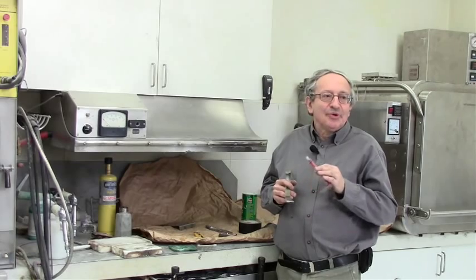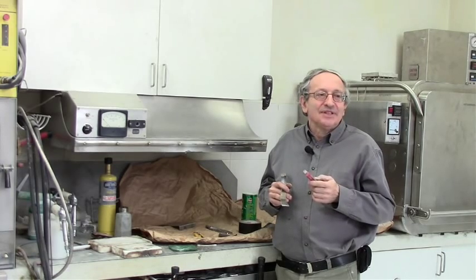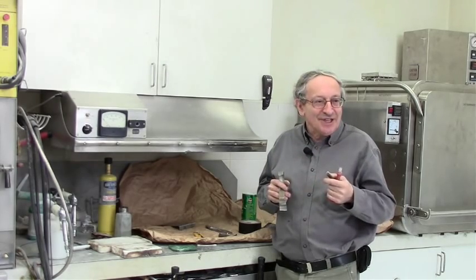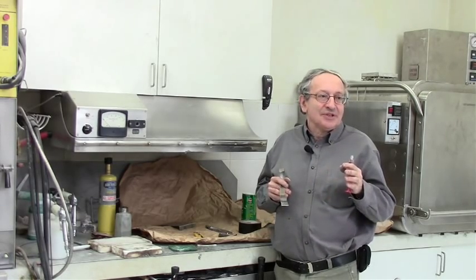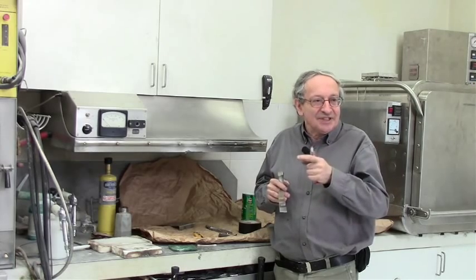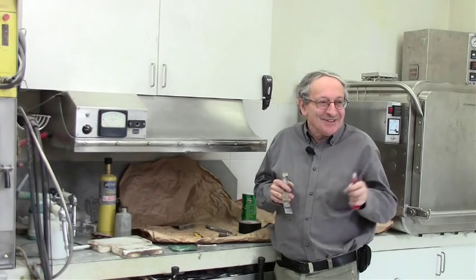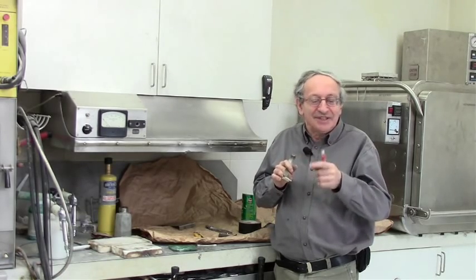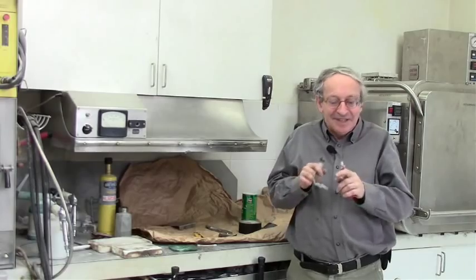Surface energy is a product of the specific surface energy and the surface area. So you can have something with a low specific surface energy but has a highly structured surface, so the total surface area is very large, because what matters is the product. So you can take Teflon, which is hydrophobic as hell, and you can make it hydrophilic by texturing the surface enough that there is so much surface area, then when multiplied by a low specific surface energy, it still gives a big number. So that's the trick. So the trick is why this retains more is simply because what matters is the product of the area, and this has much more area than this. That's what does it. It's not the mechanical anchoring, it's just the fact that the area is so much bigger.